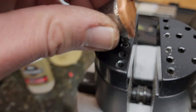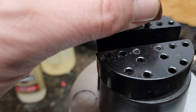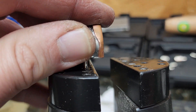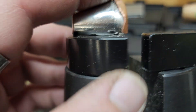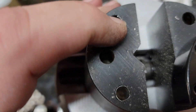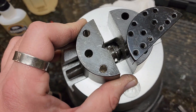Anyway, just wanted to make a quick video showing the solutions. Now that they're shimmed up, let me show you — you can see how perfect this guy fits. It's so tight — it just perfectly takes up the slack, and as you see, there is no movement in that jaw. This one rotated on the inside so I need to make a bigger shim, but make a bigger one like this one and you won't have that flex. Anyway, just wanted to show and share that solution — thanks for watching.